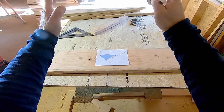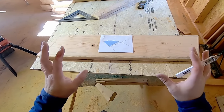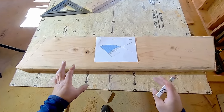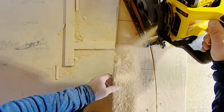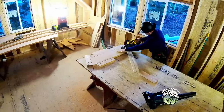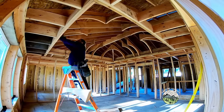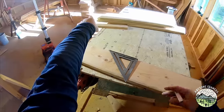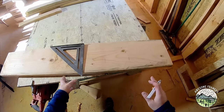The inside corners — the curves — are going to be ellipses. I don't want to get fancy with a jig, so here's how you lay this out without anything special: if I divide my curve into even numbers — there's the curve. I have all my rafters cut, all the curves are cut. Now I have to cut all the inside corners, which are ellipses, but first I've got to cut them like they're hips and valleys.